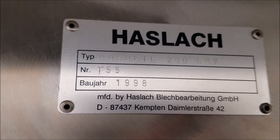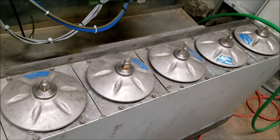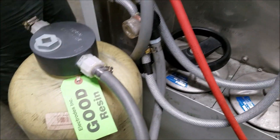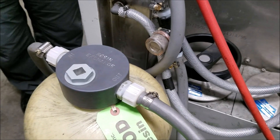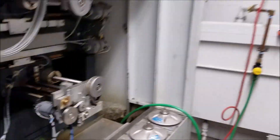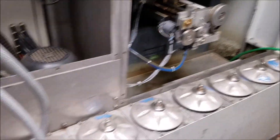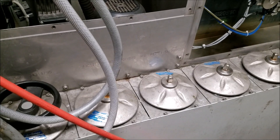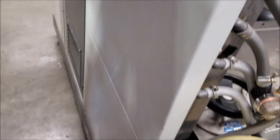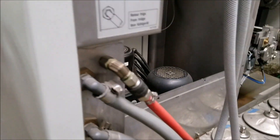We go through a resin tank once or twice a year. I go through filters every 750 down to 75 cutting hours depending on what I'm cutting — soft materials will clog the filters faster. With a lot of aluminum, copper, or magnesium you need to change the filter more often. We shut the bolts off, use an air ratchet to make life easier, pull all these out and pull out the cartridges. It doesn't have an automatic filter timer on the tank.